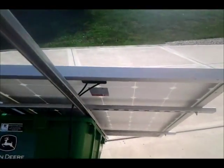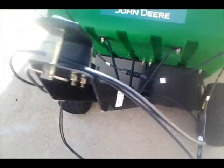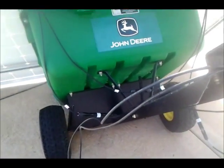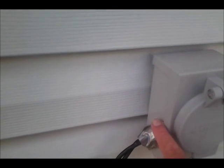I can rotate it to whatever angle I want and turn it to track the sun. I'm retired so I don't mind coming out several times a day and reorienting. I have 30 amp fuses on my panel connections. I've got them connected in series right now — I had them in parallel initially, as you'll see in my first video. The manufacturer recommended going series to get higher voltages, as the Odyssey charge controller works better with higher voltage.